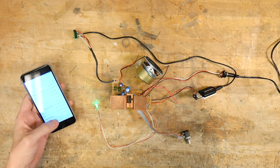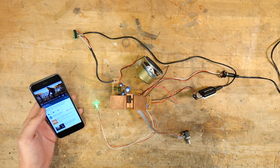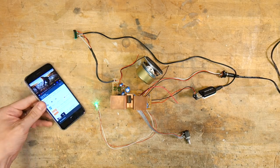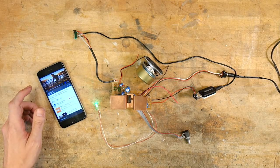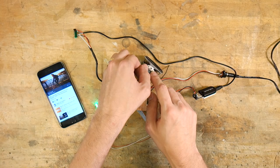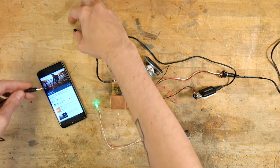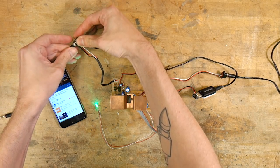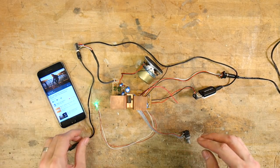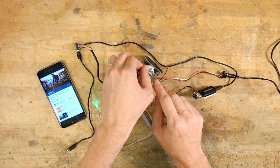Connect the Bluetooth from your device and play some music. I have not soldered in the speakers yet, but touching the leads to the speaker is sufficient for now to see if everything works. If you wired up your switching audio jack, the audio should stop if you plug in anything into that jack, and should subsequently also start if you disconnect Bluetooth and play via cable from your device.